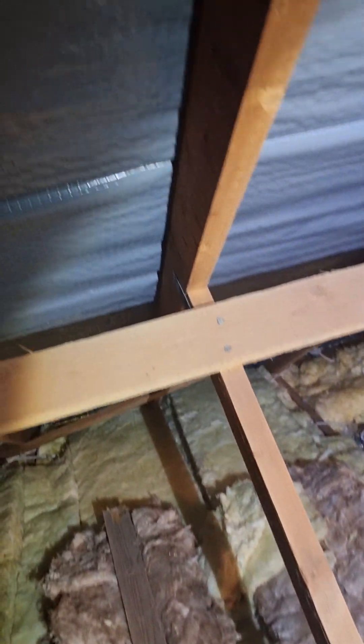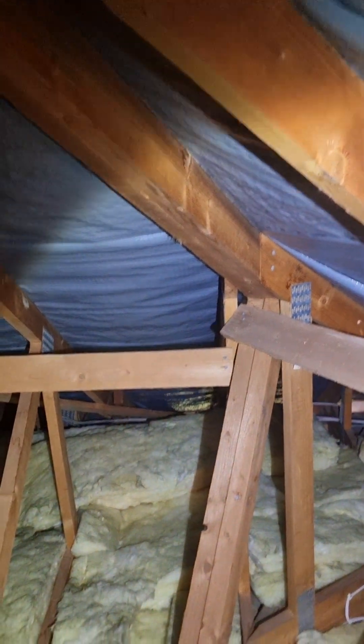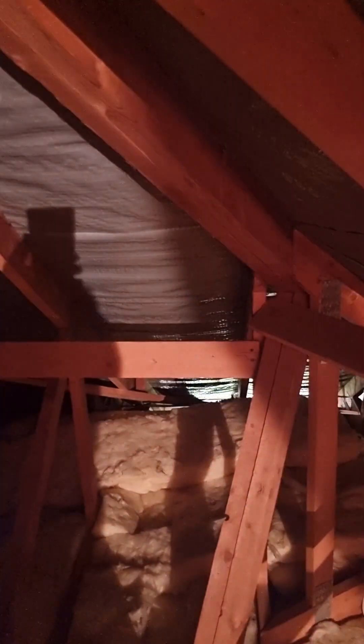This is set up as a cold roof, so I'm looking at the under felt now. It's a fairly taut plastic under felt, typical of late 1980s into 2000s, and this house was built in 2000 so that's quite old tech really. If we turn the torch off we can see some daylight coming through, which gives us some idea that there's relatively good ventilation.